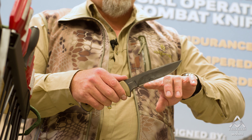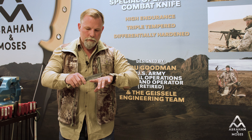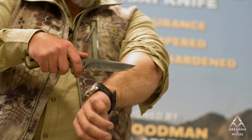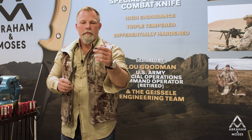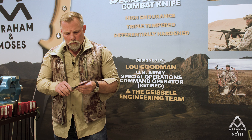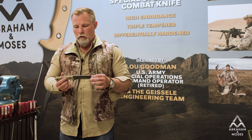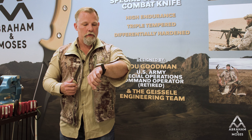No fracturing of the cutting edge. Let me run my fingernail on it — smooth there. Still bites into my fingernail. Let's check and see if it bites into the hair — still bites the hair, still shaves hair off. Not too bad. So you can see some of the attributes of a high-endurance differentially hardened blade. We made multiple cuts, some over 50 cuts of all the different media, and we wrapped it up with chopping the 2x4 in half. Edge retention is very good, no harm to the cutting edge at all, and it still shaves hair off your arm.